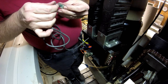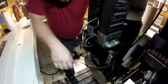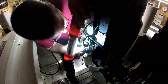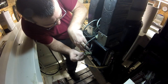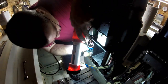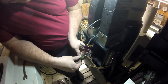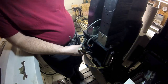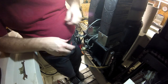Now we've got all the power wiring done and we're looking at the resolver wire and cable. The resolver connector here is in really poor shape — they used a Molex connector with very poor strain relief on the back side, which is going to lead to issues later. There's also a ground wire that bonds this metal box to ground, so we need to disconnect that. Removing the back shell to see the damage — this thing is toast. That zip tie was on so tight it crushed the wires. There was actually a broken wire on a pin, so I was quite surprised the spindle encoder worked as well as it did.